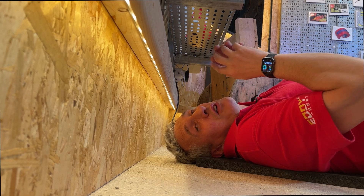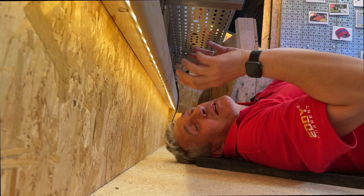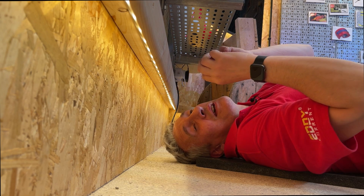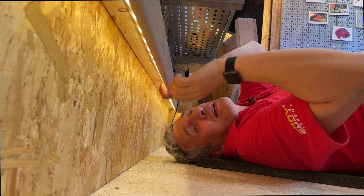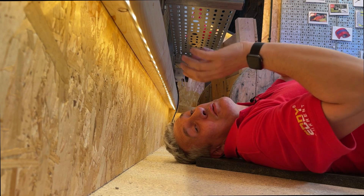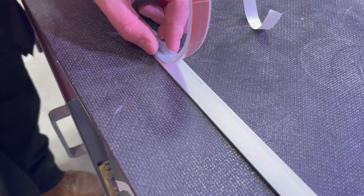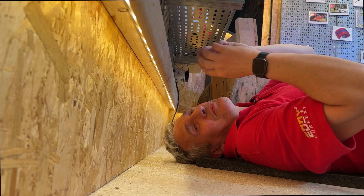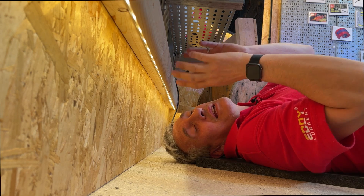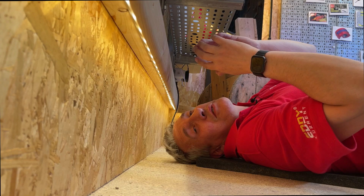I don't really like spending my life upside down on a dusty floor trying to install LED strip into this feature. Our top tip for making your life incredibly easy is to do as much as possible on the bench — instead of making connections and sticking tape from the strip to the feature in situ, fit it onto an aluminium profile on the bench, bring it in fully tested, and just put in the final screws and make the final connection. We've also put some clear adhesive-lined heat shrink at the ends of the profiles because that's where they tend to peel away, adding extra resilience to the LED strip before installation.